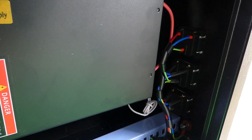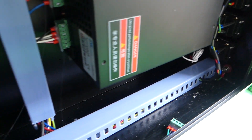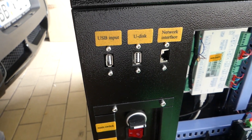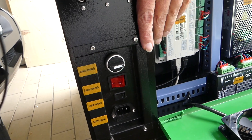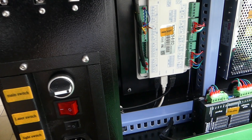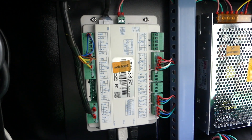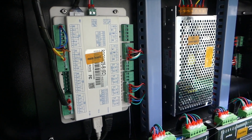What you can see down here on the edge is there is quite a lot of metal shavings all through the machine — I'm going to really have to clean this out to make sure nothing bad happens. It did come with the network interface already attached and the switch panel down here, which I think is pretty standard but it's fully configured. Down here you can see the controller is an RDC6442SB, which kind of proves that this is a Ruida — really happy with that.